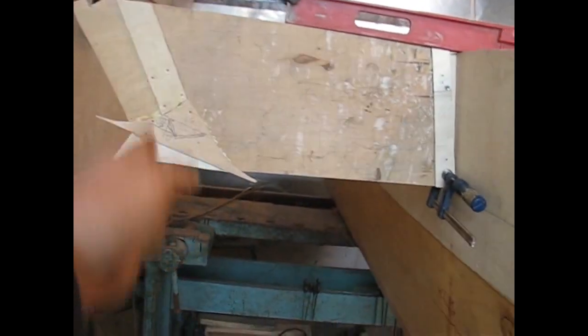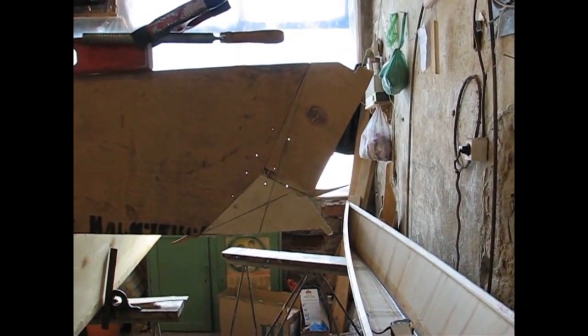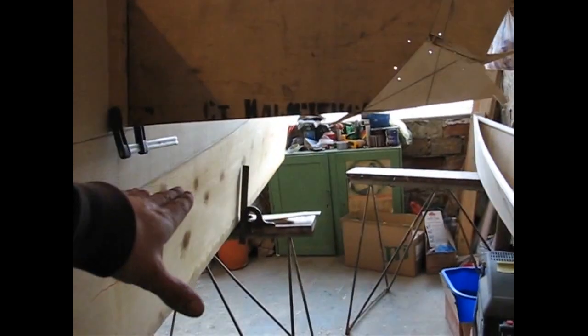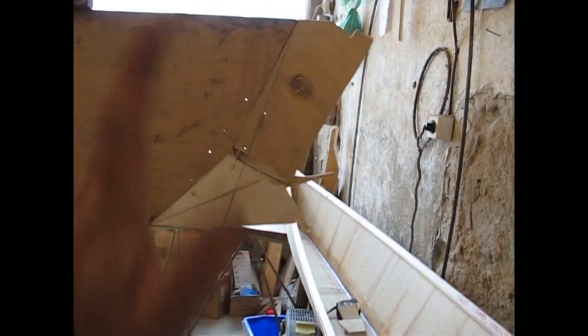I glued on some ugly pieces yesterday. Yesterday's cut was like this and like that — that was my main bulkhead of the lee pod. But I figured out really quickly it's just not enough volume and not the right shape. As I was moving the boat onto its side, playing with levels and getting my waterline — knowing the waterline will be rising as the boat heels — I just didn't like what I came up with yesterday. So I glued on those pieces with screws and PU. Really ugly job — I admit it. Now we're going to cut it.